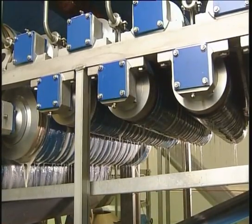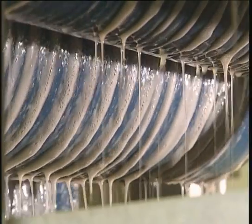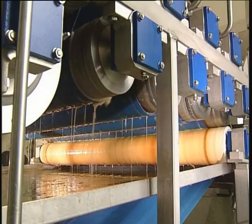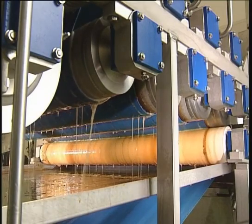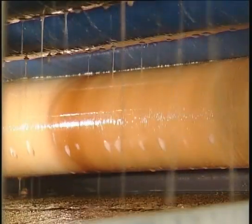In a second stage, the pressure on the mash cake is increased with decreasing roller diameters and more juice is continuously extracted. Additional vertical pressure on the mash cake can be applied with specially designed press rollers called nip rollers at the end of the pressing process.